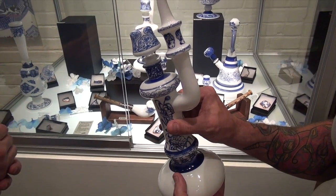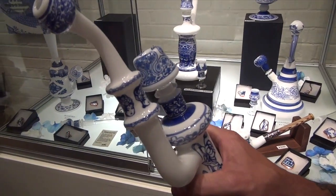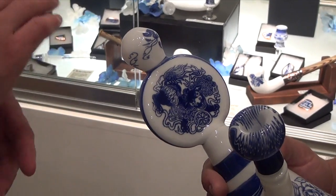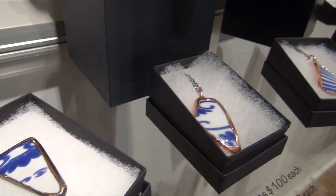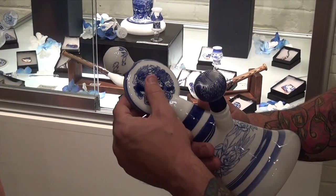There's a white layer and then a blue layer, and then a stencil goes on top. I use a sandblaster to carve away the blue to reveal the white, and then the stencil is removed and reveals the image. It's multiple layers of glass. When it all comes out of the sandblaster it's all rough and blasted and coarse, and then it goes back to the heat and gets polished — melts it all back down into the glass again.